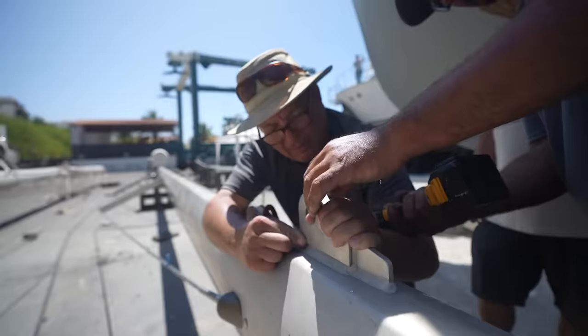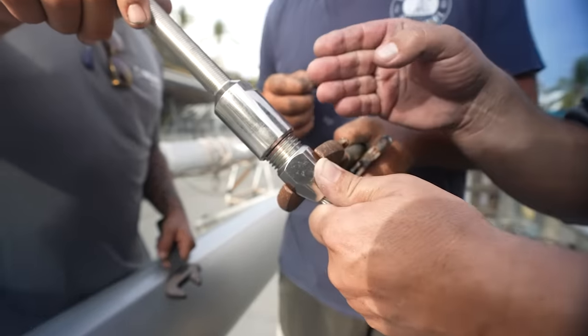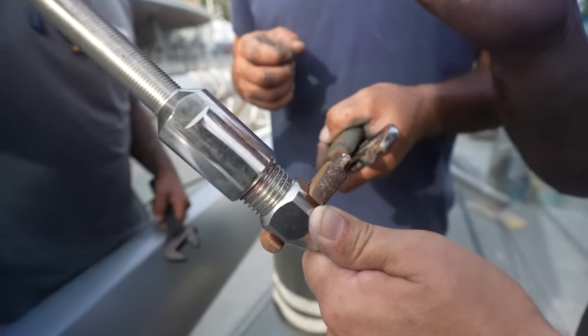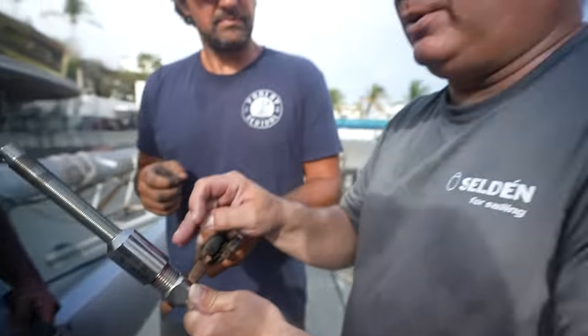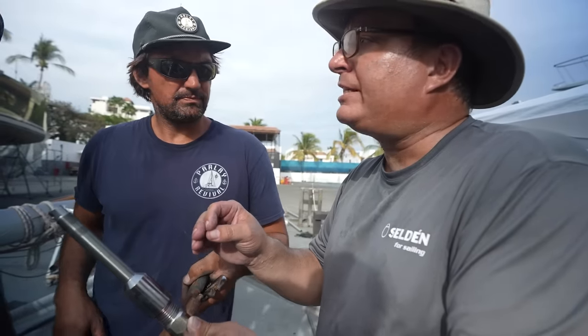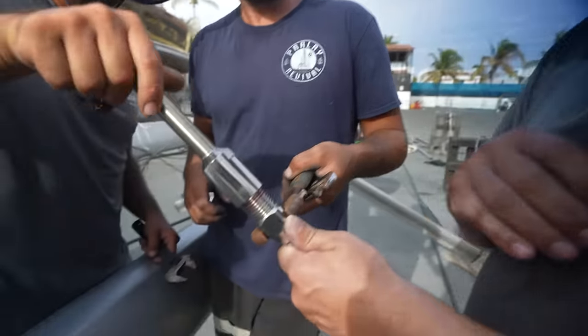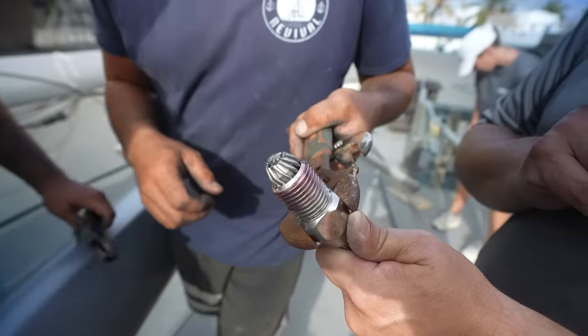So the Loctite will lock the threads, right, once it dries up. Yeah. But since it's stainless on stainless, I like to use it, it also works as a lubrication. Right. So just to make sure we don't seize the threads before we even get to enjoy our stay. Okay. And now let's see how it looks. Look at that baby.